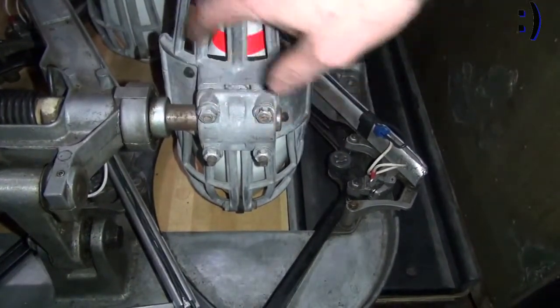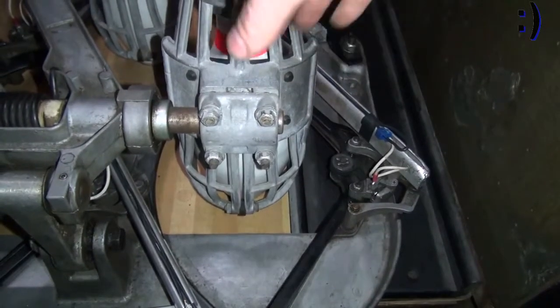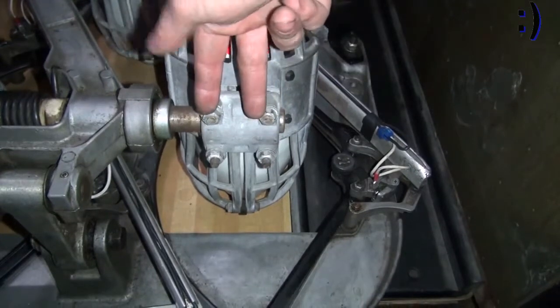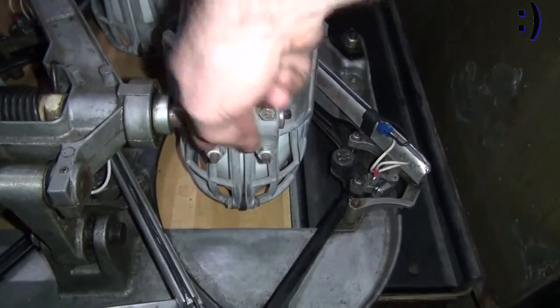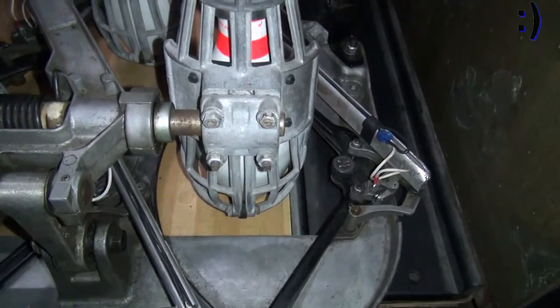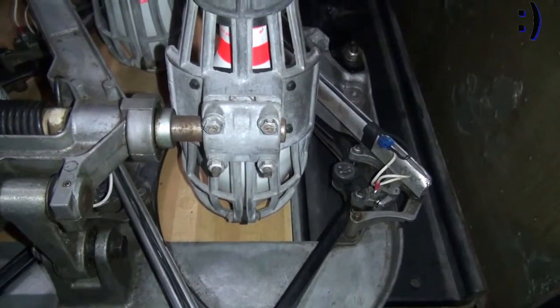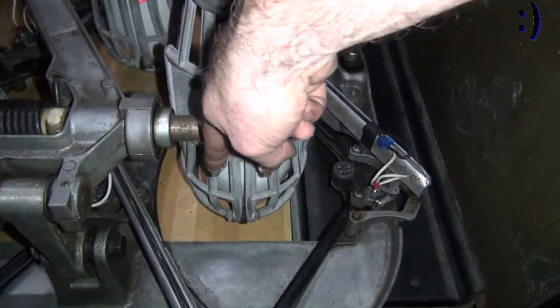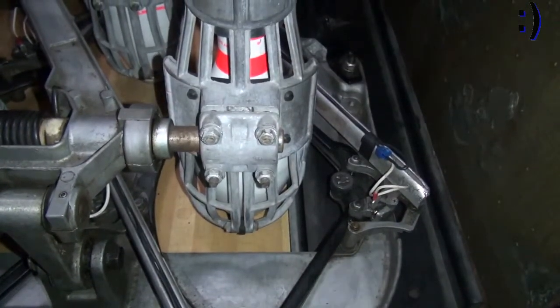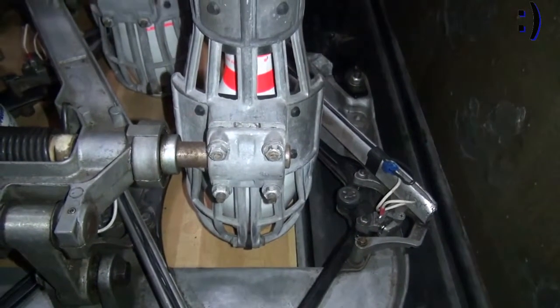If the pin is too far forward, you need to tilt the cup forward to bring it back. To do that, loosen the top, tighten the bottom. If the pin is too far back, you need to tilt the cup back to bring it forward. Loosen the bottom, tighten the top. Do all 10 cups. Once all 10 cups are done, you can move on to the next step.